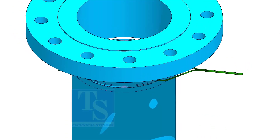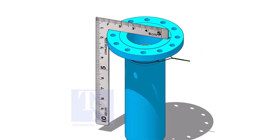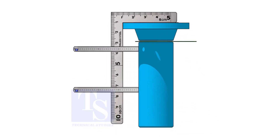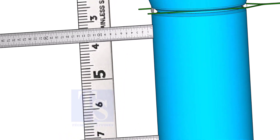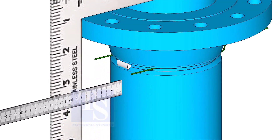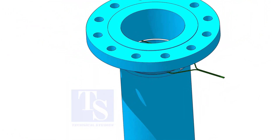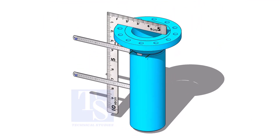Since the length of the pipe is not too long, put it in a vertical position. Put the gap rod and the flange on the pipe and set the gap. Correct one side and tack weld on opposite sides. Correct the other side and tack weld as shown.